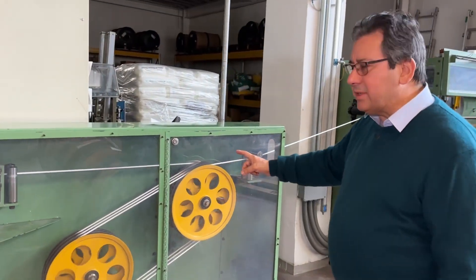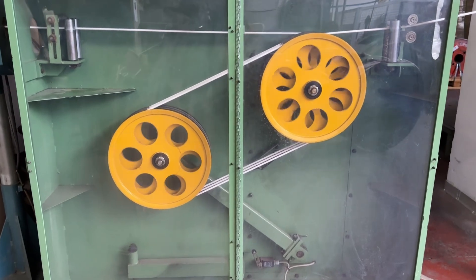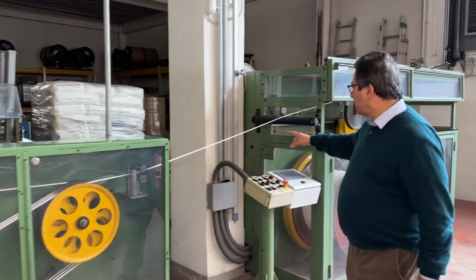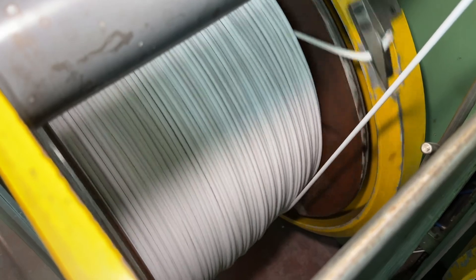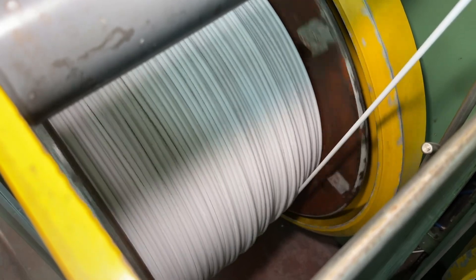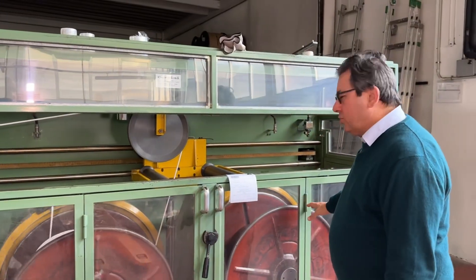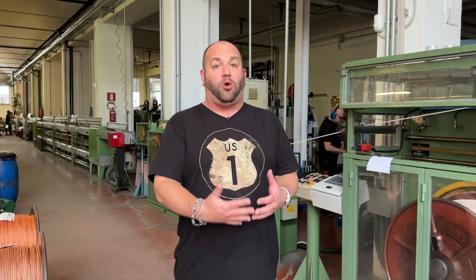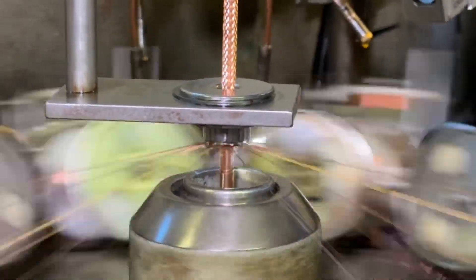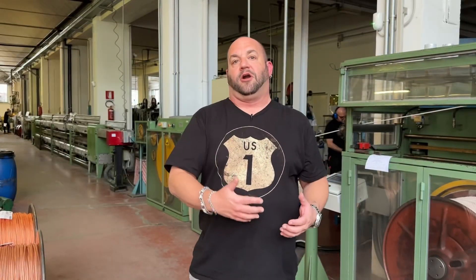Then there is a compensation system, and here we are gathering all the dielectric which will be automatically moved from one bobbin to the next as soon as it becomes full. Now that we know how the high-pressure triple-layer foam dielectric is applied to the coaxial cable core, stay tuned for the next video in this series, where we'll look at how the foil, braid, and shield are applied.